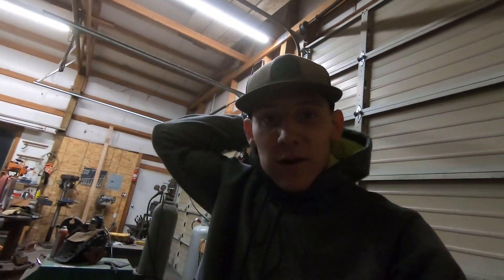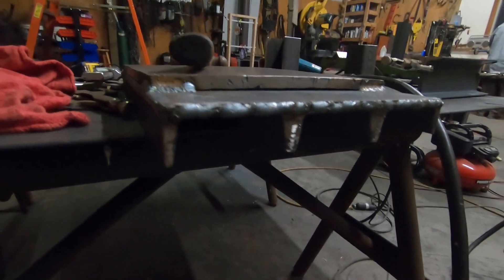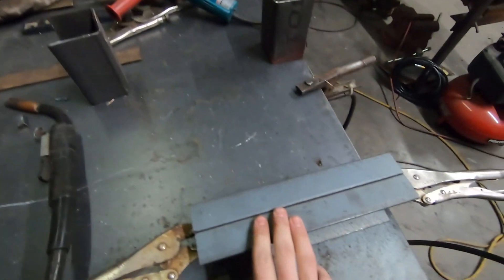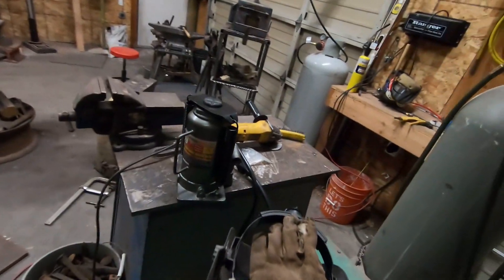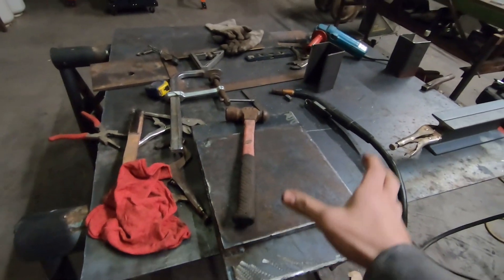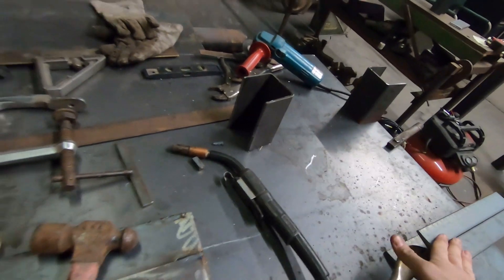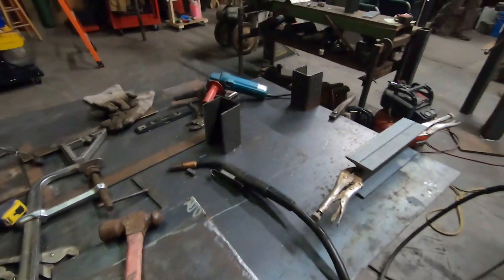We made some pretty good progress so far. We're going to go over and show you what's going on. So this is a 3/16 inch plate welded to channel that is welded together with half inch plate. This is going to be welded into basically an I-beam — it's just channel — and that's going to be what the press itself pushes up on. There's going to be some square tubing that comes up from the sides, and some other square tubing that'll be attached so it can slide up and down, and it'll all be controlled off of hand controls.